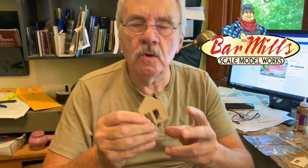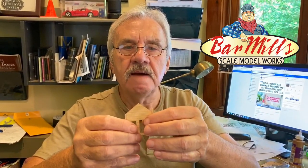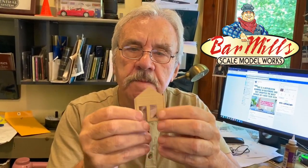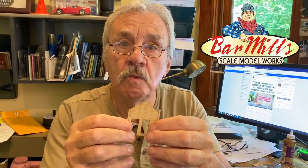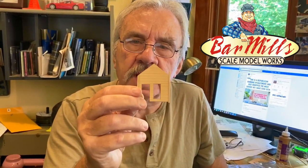A lot of people don't realize this, but when you're adding corner posts to a wall you're actually making the wall wider. In this case you're adding 5/32" on each side, and it affects the whole geometry of the building as far as roof installation goes. This approach works if there are no interior braces — and it works if you're painting the shell of the building and the corners the same color, because the corner posts are vertical grain and the walls are horizontal grain, so they support each other and become quite rigid.